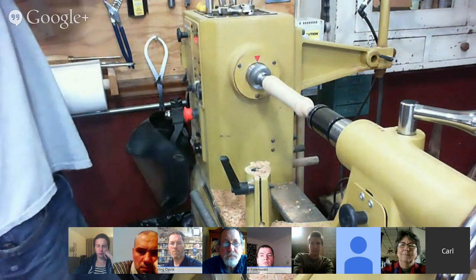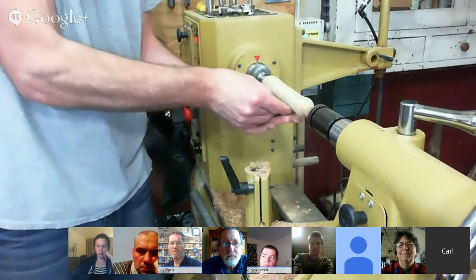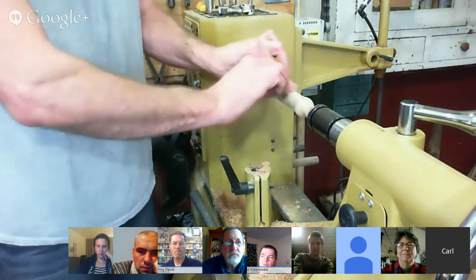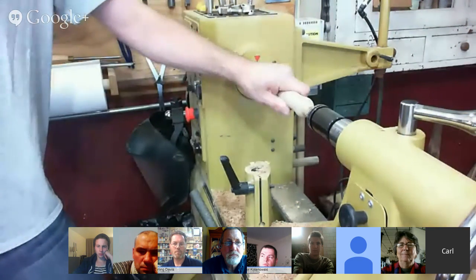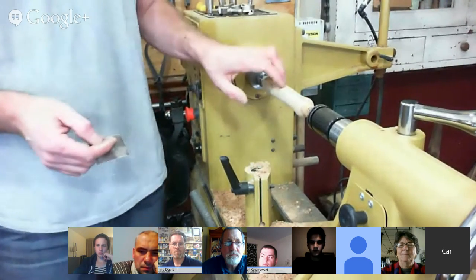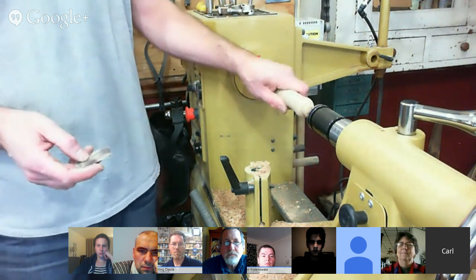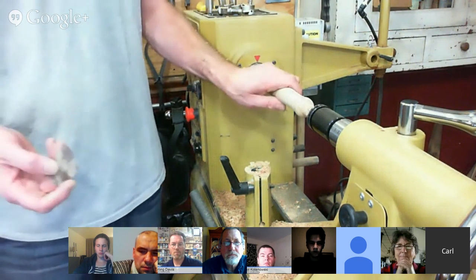Probably don't want to see me sand this whole thing, right? All right. And the other thing is, when you switch grit, so you go from 220 to 320 or whatever, inspect the piece and make sure that it doesn't have scratches when you're done. So if it has 180 scratches in it when you're done with the 220, they're going to be there. You're not going to be able to get them out with 400. So make sure as you go that you're getting the scratches out from the sandpaper behind.